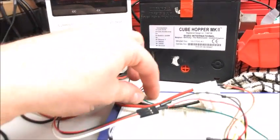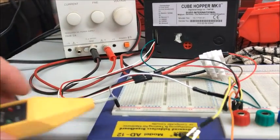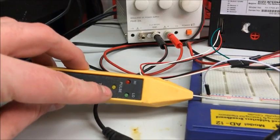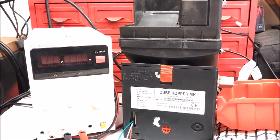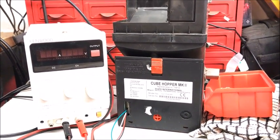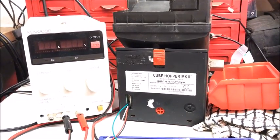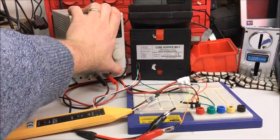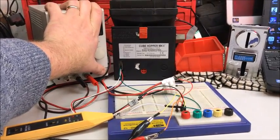I've got this green Sense 1 cable connected to this end here so that I can use this probe. I'll turn it on in a minute and you'll be able to see that a pulse is given out for every coin that is ejected from the coin hopper. So that's going to be our first test. If you haven't got one of these logic probes, no worries — this is just to prove that as a coin is ejected we get a pulse on the logic probe.